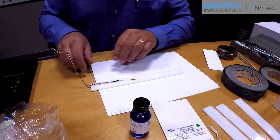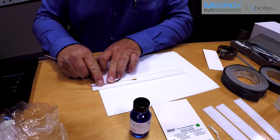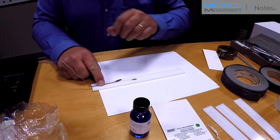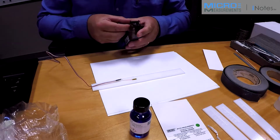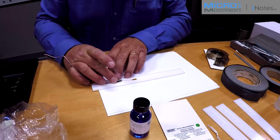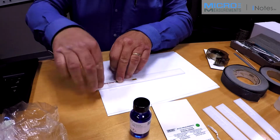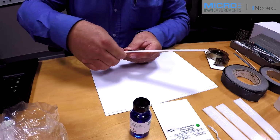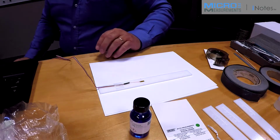And now it's important to put a little bit of a service loop in those fine transition wires. So with a little extra care and handling, we can sort of decouple the cable from the substrate. With that little service loop, I'll take a piece of the gauge installation tape and tie the vinyl insulated 3-conductor cable to the 3D printed beam just to give us a little protection from any tugging or pulling that we might do to that cable.